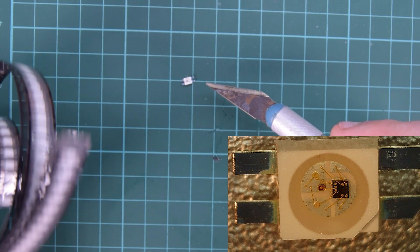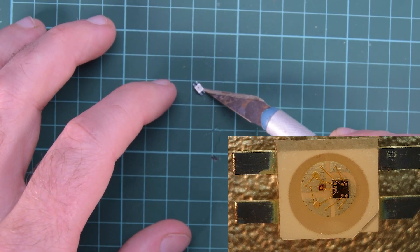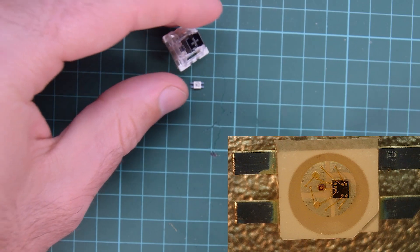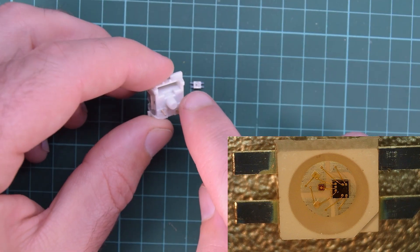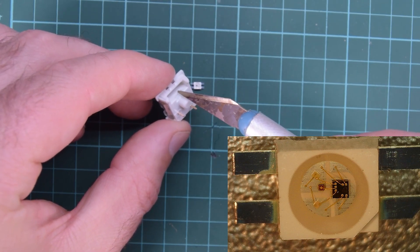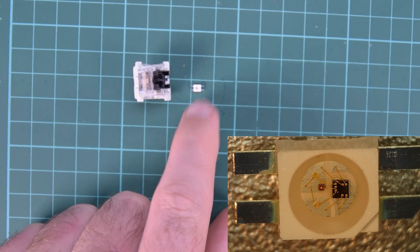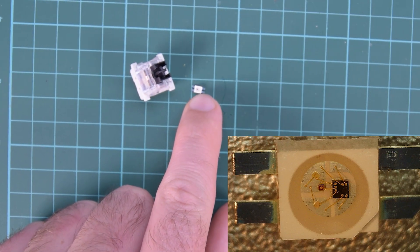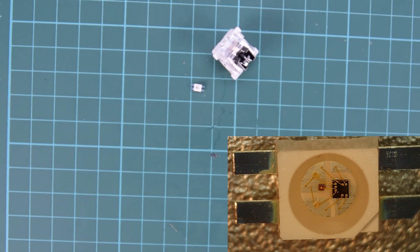Pretty cool things — they're kind of expensive. It was $14 for 100 of them, so about $0.14 each. I think they're going to be pretty cool. They're made to fit down the little slot in the Otemu or Cherry MX style switches — this would sit on top there and shine right through the bottom of this little slit here. There's even a cutout to give some space for it too. So that's pretty neat, it should work really well. I got the 12 milliamp variant, so it's going to be quite bright. But what's nice about a NeoPixel is you can also dim it — you can tell it to be less bright. Here's hoping this is going to be a lot of fun, because I think my next macro pad will be stacked with features.